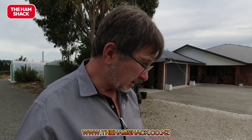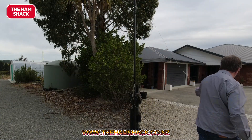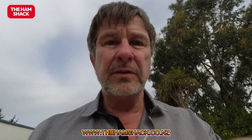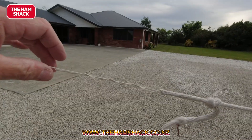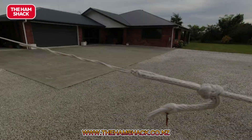First we pull the terminal block to the top of the pole, tie off the ends, and check the SWR. The terminal block is tied at the top, with wires on either side. The whole antenna is going to weigh probably about 150 grams, or maybe 300 grams including the coax — very light. On the ends I always twist the wire back on itself rather than cutting it — I measure 15 centimeters and twist it back so I can adjust it later if needed.